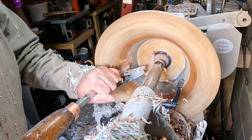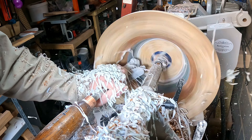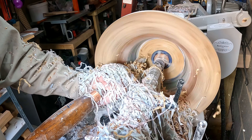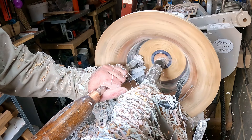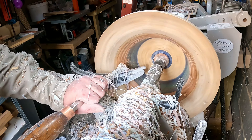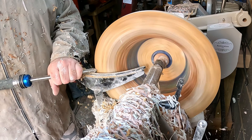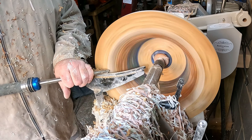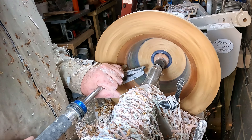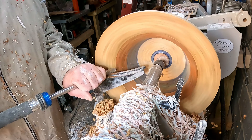Using the carbide I gradually thinned down the resin. For this project I was heading for a sidewall thickness on the thick side of 10 millimeters or 3/8 of an inch. I also had to keep an eye on the join between the sapele and the midsection — this was already as thin as I wanted it to be. There was still a bit more work to the rim: patches of glue had to be removed and the overall profile refined, so I went back to the gouge, sweeping the curve up from the resin out towards the edge of the rim.